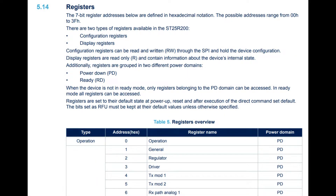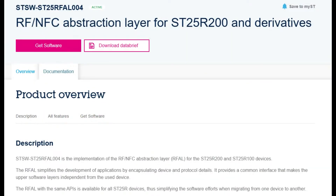There are a lot of registers — many of them just configure the transmit setup, antenna type, speeds, and decoding. I would not try to write the driver from the register map because it's pretty intense. Instead, check out RFAL — the RF Abstraction Layer that ST has written. ST is pretty good at writing portable code, so you don't have to use an ST microcontroller with this. I downloaded the code and looked at it — it's pure C, so you could use it with C++ or C, on Linux, or on a microcontroller like Arduino, as long as you have enough flash and RAM. You just need to implement the SPI low-level interface, which is a standard SPI.